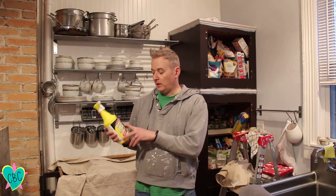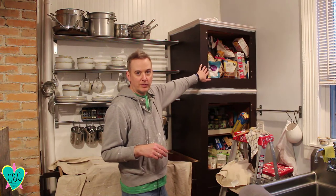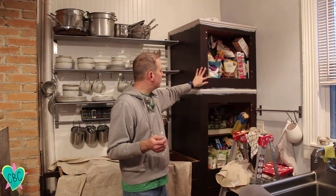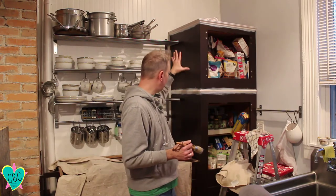Day number two on our cabinet renovation. First thing I did was clean everything really well — I used Grease Lightning, you just need some sort of degreaser. Then I take a wet cloth and go over it to remove any cleaning residue so it doesn't affect our paint. After that I remove all the cabinet fronts and the drawers as well. One important thing is to label the hinges so they go back on in the same spot, because sometimes they've bent a little bit over the years.